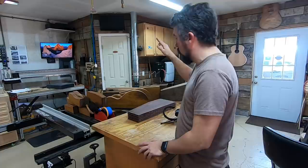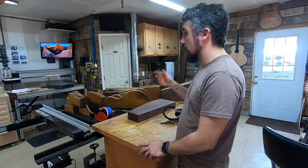And the next video that I do, I'll show you guys what I ended up getting as far as how much wood came out of it all. But the process is going to be the same. What I've got to do, now that we know, is run these things all through the planer to get a true surface. I'm going to run them through the bandsaw, and then I'll come over here and stack them